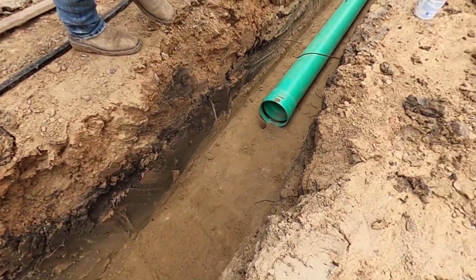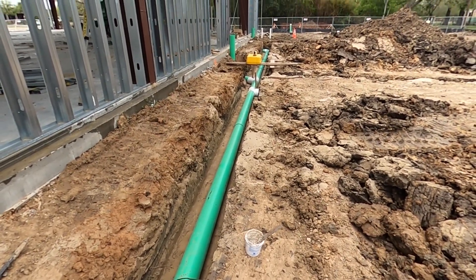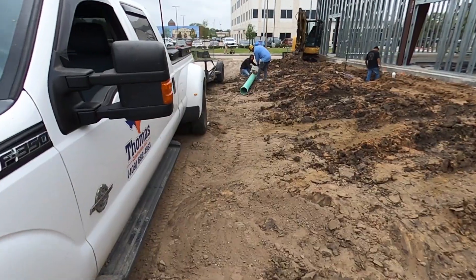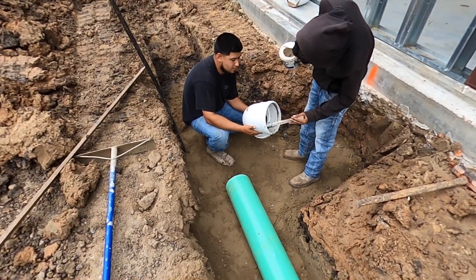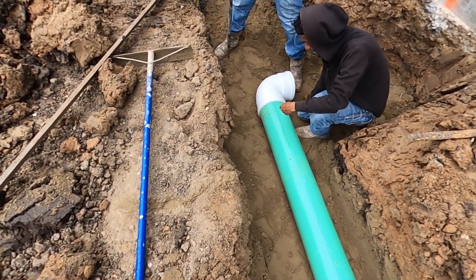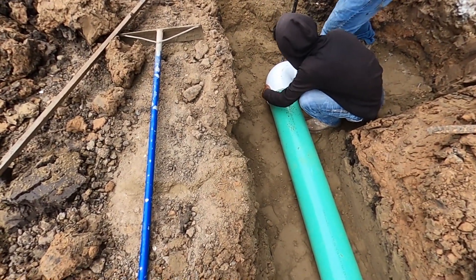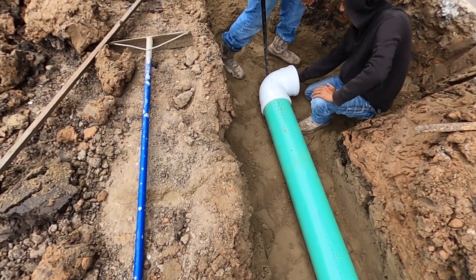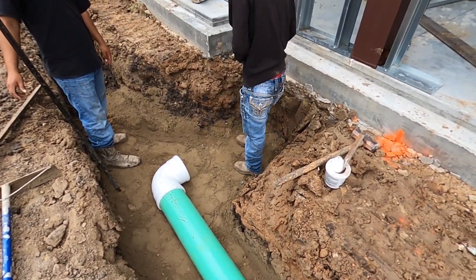Looking back at the progress being made — you can see it all in there. There's that laser down there doing what it's supposed to be doing. Looking good. Now we're going to install some more pipe. That's not glue — that's pipe dope. It helps slick it up, helps it slide on there, helps it seal. Make sure everything is clean. Right here you see why they call it push pipe — get you a six-foot-long wrecking bar and start pushing. It'll go right on up there.